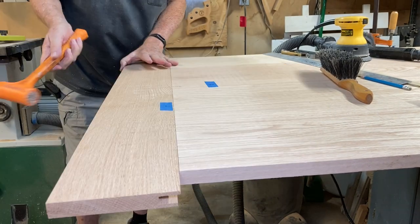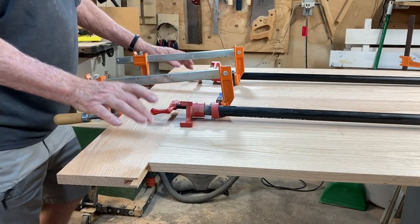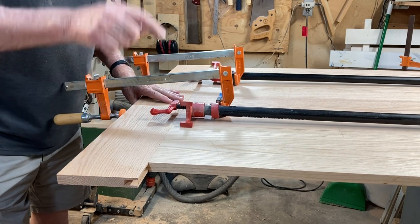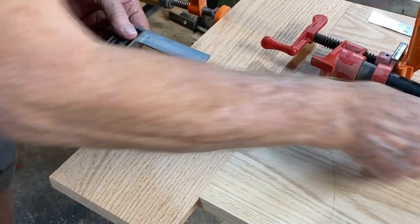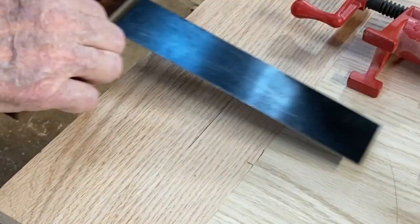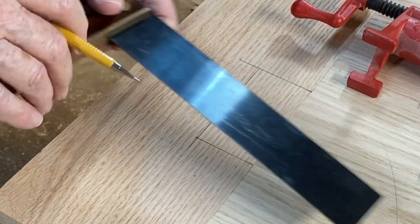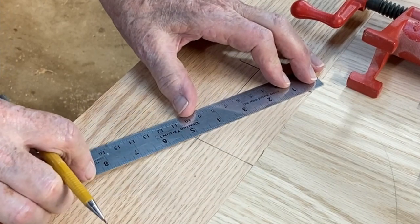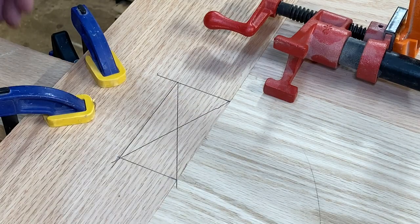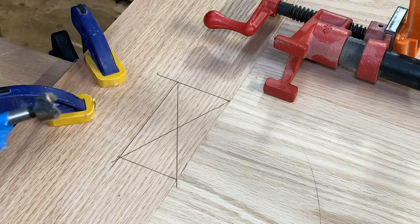A little bit of fine-tuning on these tenons — I'm liking that. Now it's time to put the dowels in. I put a couple of marks where the tenon is, find the length of it, and find the center. That way I'll know where to drill the dowel hole. To find the center, I'll just go corner to corner and strike a line. I've got a sacrificial board underneath so it doesn't blow out the bottom. I like to use Forstner bits — they give a nice clean cut and I feel like I have a lot more control.